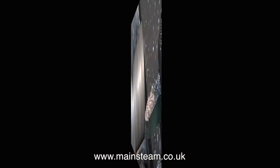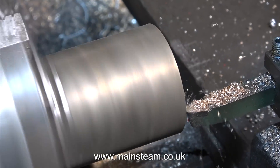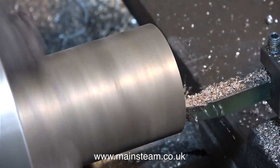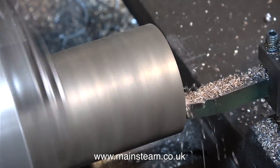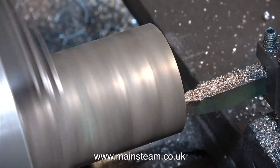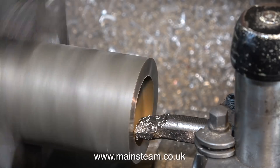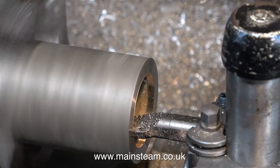I need it to be just over two inches — I don't want it to be a tight fit. So now with a piece of brass fitted in the self-centering chuck in my Smart and Brown lathe, I'm facing off the front edge of this to make it square. This brass is a piece of tube, so it will save time when I start to bore it.